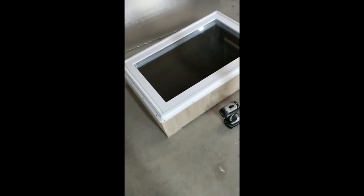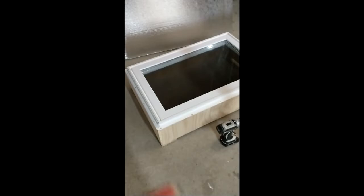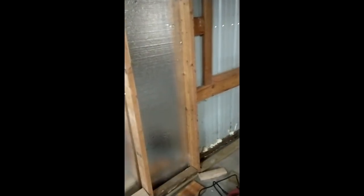I'm thinking about doing a second window over here — it just takes more time and more money. So that's one way to get it done without tearing the siding off and making crazy cuts. It serves two purposes by giving me a box to work with once I'm done. Also, I made that box about a half an inch bigger than what my framing sticks out to accommodate for my drywall, so my drywall will go right up. You've got to add that into the mix when you do it.